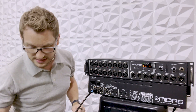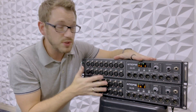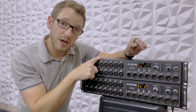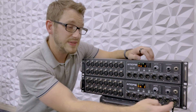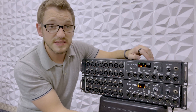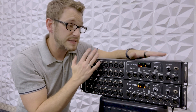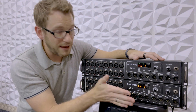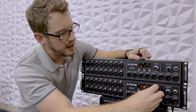I'm going to rotate these and get them connected. I now have my two units plugged in — the X32 A port of AES50 is plugged into the A port of my top unit, and I've taken the B port of the top unit and plugged it into the A port of the bottom unit. Now, like I was saying earlier, I need to set my configuration so that I have outputs 9 through 16 on the bottom unit's outputs. To do that, I press and hold config, rotate this to 9 through 16, and simply release it. We'll notice that out plus 8 is lit, and that is the way I want it on the bottom unit. If I wanted 9 through 16 on the top unit too, I would do the same thing there. So my top unit is 1 through 8 and my bottom unit is 9 through 16.